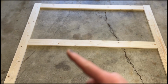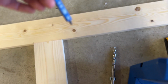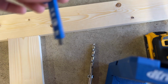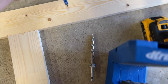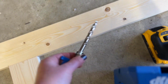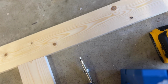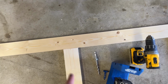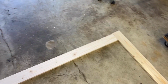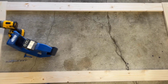Now to put it all together, we are going to do my favorite thing, pocket holes. Okay, I'm not going to bore you on how to make pocket holes again, because there is a video up on my channel and I show you how to do that. But first you measure the depth of your wood with this little doohickey here, and then you put the stopper in to where it tells you how thick your wood is, and then you drill the holes. Now we're going to drill them going this way, this way, this way and this way. So we just need to do the pocket holes on the stretcher parts.